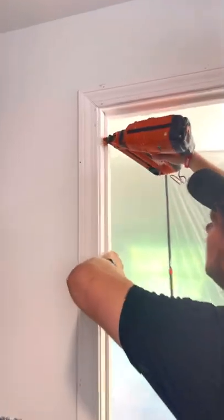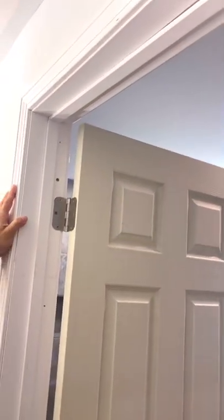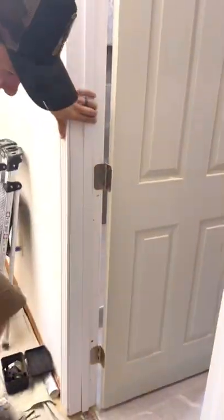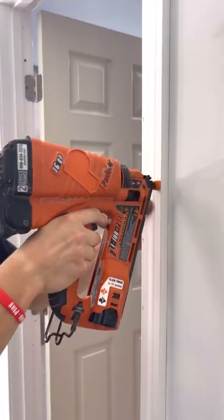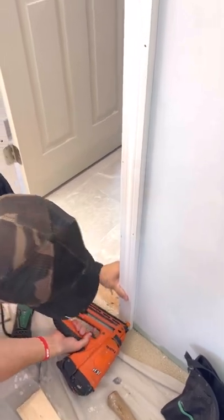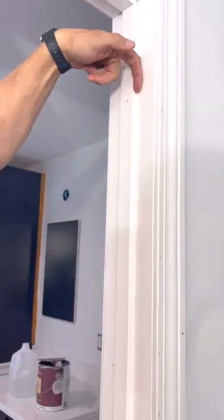I'm just going to add a couple of nails right here. We have this piece that we took off before, and all we have to do is put it into that groove — just like that. Then it will hug the wall. Literally just squeeze it, pinch it, nail it in. The last thing you want to do is add a couple nails because this piece is slid into here, so you want to make sure it's secure. That basically catches that tongue in there.